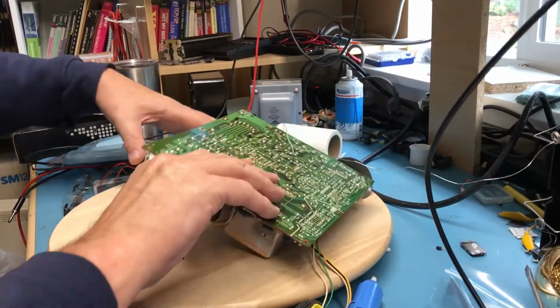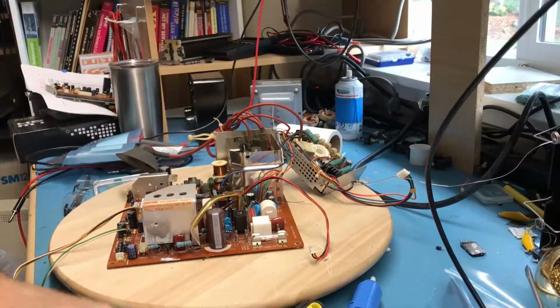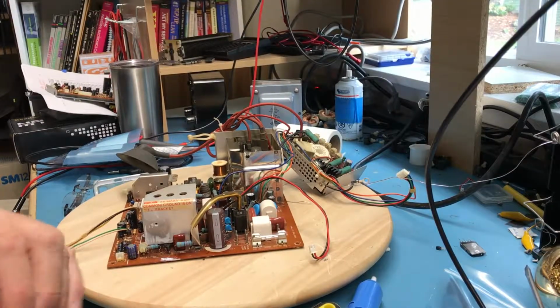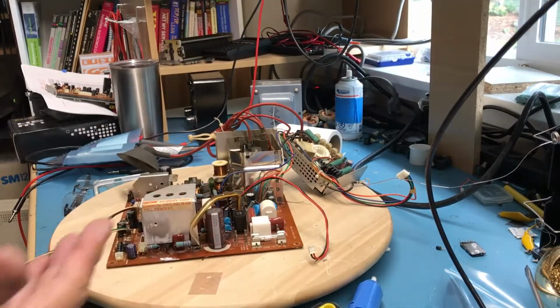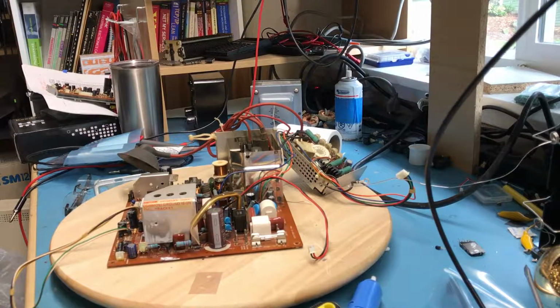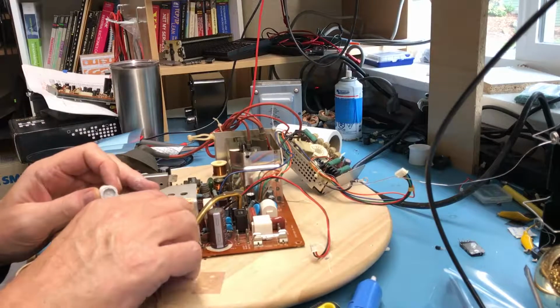It's the same process I talked you through before, where I will get it fully mounted first, and I will solder it after to help reduce stresses. Same as we saw before. It's got this little mica washer. I've of course got heatsink compound all over myself here, as I always do. This stuff is just difficult to work with.